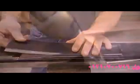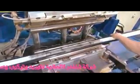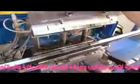He covers it with a piece of thermoplastic urethane and again uses a heat gun to join the pieces. He wipes it clean with alcohol. Then he heats it up in a mold for a minute or 2. The spliced section melts together and then cool water hardens it.